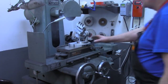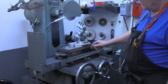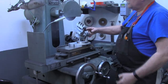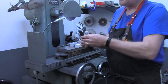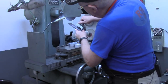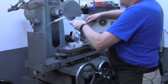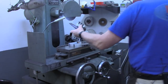I've got the universal sharpener mounted mag-down on the vise now. It's got a stop right here up against the vise. This axis is set at 90 degrees, this axis is set at zero, and this one at 30 degrees tilted back. We're going to start with the one-inch chisel. I'm holding it against the back and tightening it down, seated up against the back of the jaw.